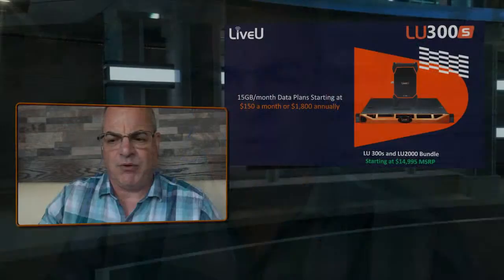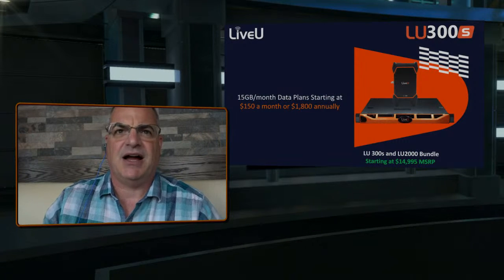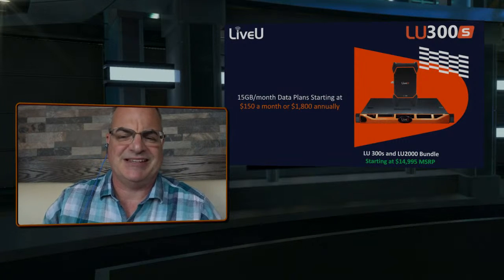We are actually taking this, I've got HDMI going into this, I could also have HD SDI, so same types of connections. In this case, this one's got 3 cellular modems, so I'm completely wireless at this point in time. It's sending that peer-to-peer to a server. So in the studio there's a server sitting there. That server has an HD SDI out of it. It can output HD SDI or NDI, depending upon which flavor you want to go with. But we're outputting HD SDI right into the back of the TriCaster, and we're getting super high quality, low latency video. I'm less than a second of latency between myself and Gary.